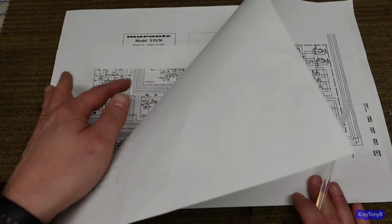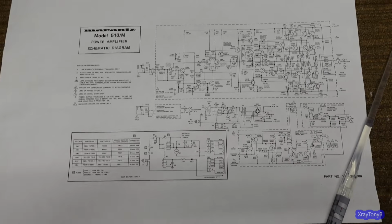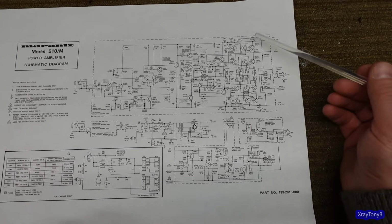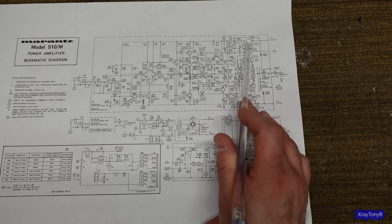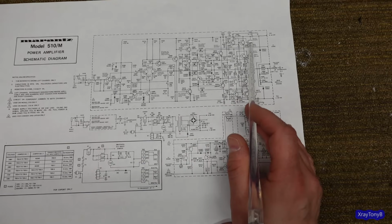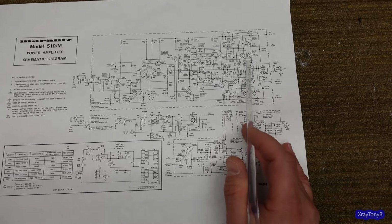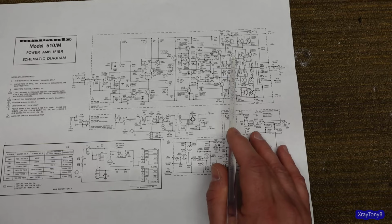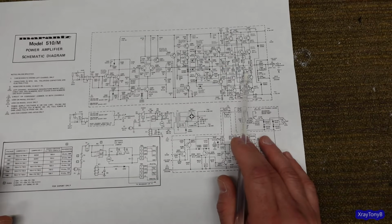But moving over to this one, big difference. And I went over this schematic on an earlier part, but you can see you still have 8 outputs. But if you notice, only 2 on each side are connected to the rails. So you have your 86 volts positive going into these 2 that are tied together, and their bases are tied together. Then as these turn on, they feed these secondary output transistors, and they're closer to your midpoint, and their bases are tied together and driven by a different driver transistor. You see that? And so this is what they call the power stack circuit.